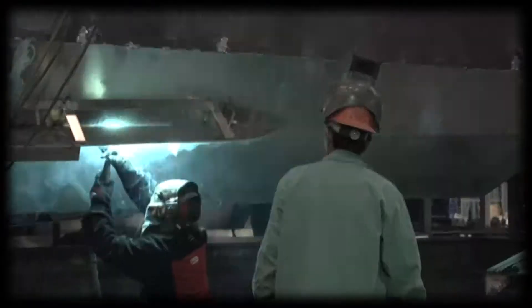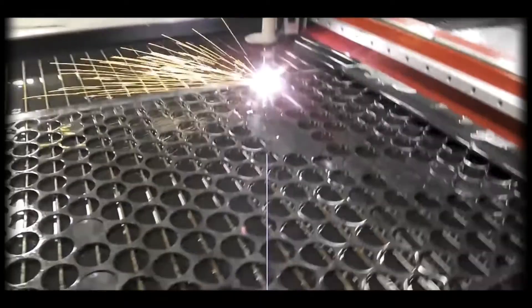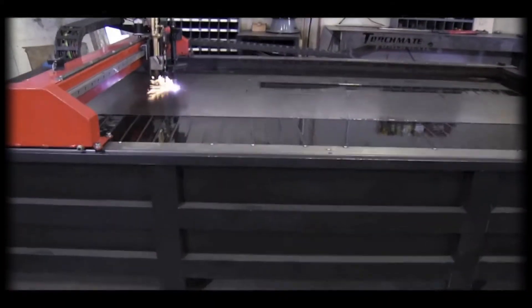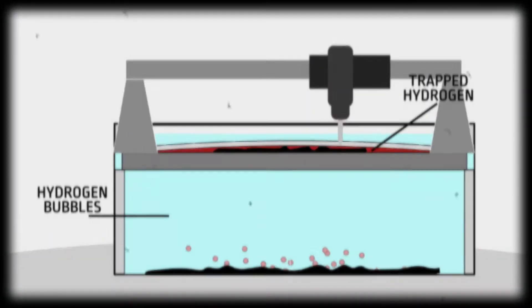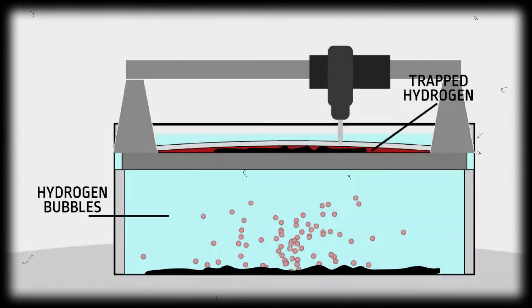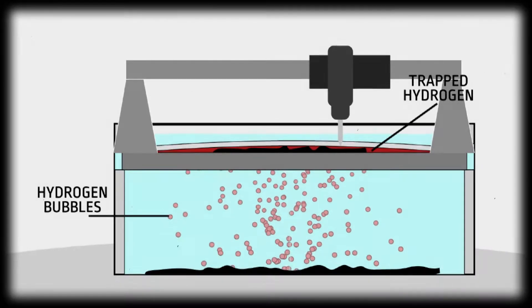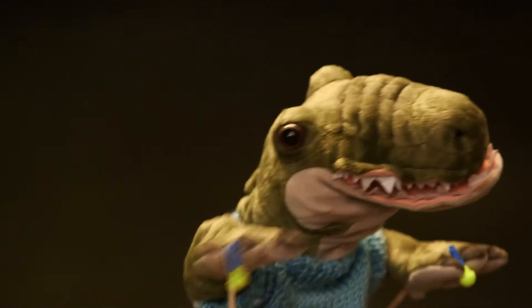Use a fire watcher buddy when working in areas where fire hazards may exist — the fire watcher may see a fire that you don't because you are welding. Do not cut aluminum alloys under water or on a water table unless you have a way to eliminate or dissipate the hydrogen gas that can be formed. Trapped hydrogen gas will cause an explosion if ignited — it's very dangerous.